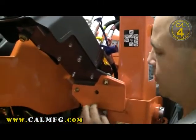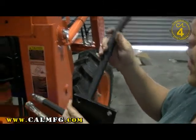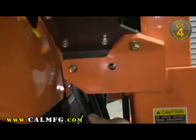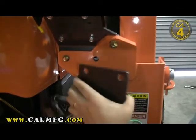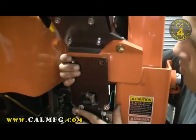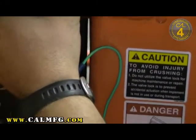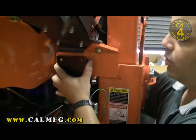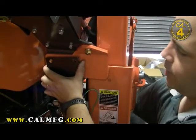Leave the back bolt in place and remove the front one. It's key that you get the hoses roughly where you want them as you're putting it in — they're a lot easier to position that way. We want to make sure that we have the two jumper lines facing towards the front of the tractor and that we've taken the pressure line and routed it where we can get to it in front of where our valve is being installed. Our valves, as you can see right here — and we'll do the electrical installation in a little while — most of our valves come with an external ground. We try to bolt that to our valve bracket because we're bolting the valve bracket to the chassis. You can internally ground these valves, but ground is critical to making it work, so we go ahead and tie the chassis ground to the coil ground inside the valve, and we tie it to the tractor on the outside.